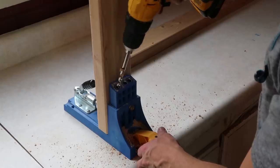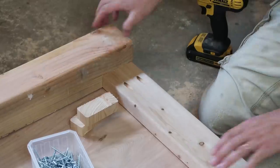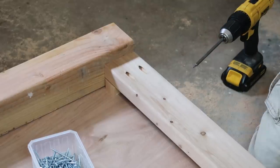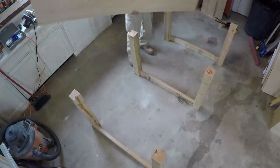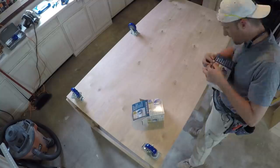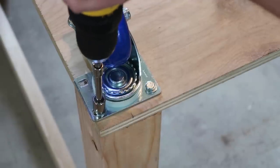I'm going to use the Kreg jig and do a pocket hole, attach them with the screws, and then do a two by four in between the two sets of legs. For these middle legs, I'm putting them in the center by setting them up on one inch blocks. I've got the three sets of legs put together. I'm going to put them upside down so the bottom is on top of the legs, screw them down nice and tight, then screw the casters in place. I used two inch long carriage bolts with a lock washer and a washer, pre-drilled all the holes, and bolted the casters in place.